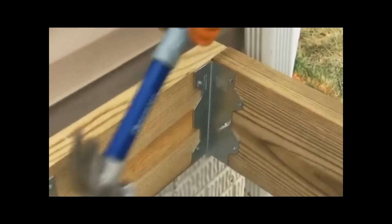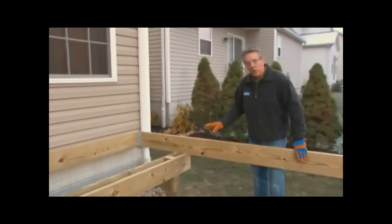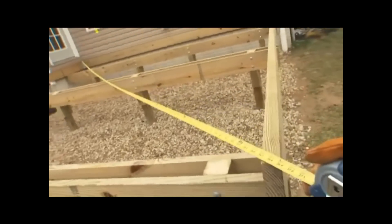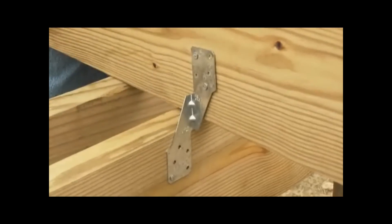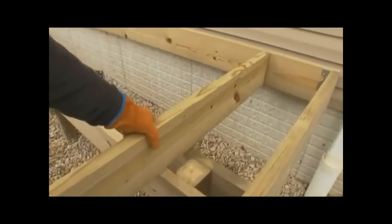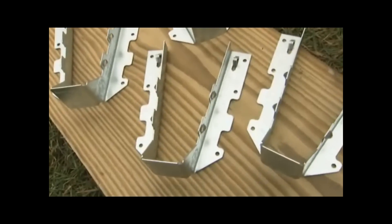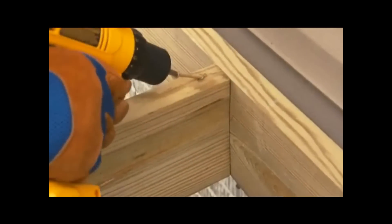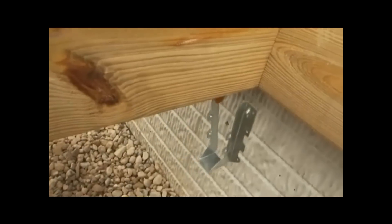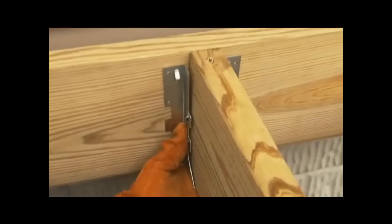Resting on the beams, hold the rim joist against an end floor joist and attach them with screws through the pilot holes. Do the same on the other end, then attach reinforcing brackets with nails. Position the frame in its final location making sure everything is square, then attach hurricane ties — brackets that hold the frame in place. Install the rest of the joists using joist hangers: hold the joist on the mark, drive a screw in the top, position the hanger tight against one side, and tap in the speed prong.